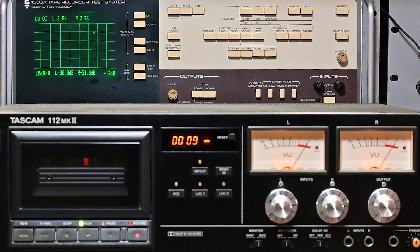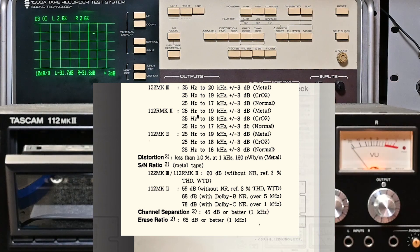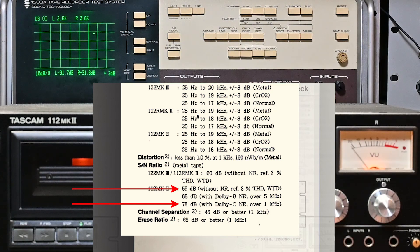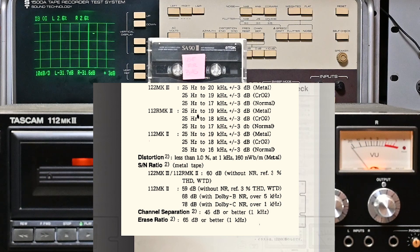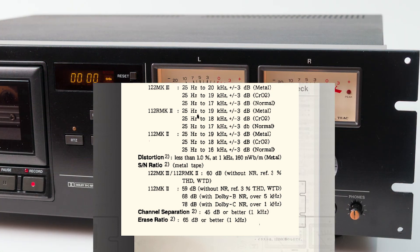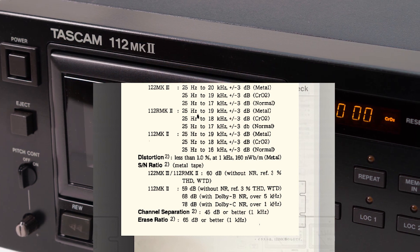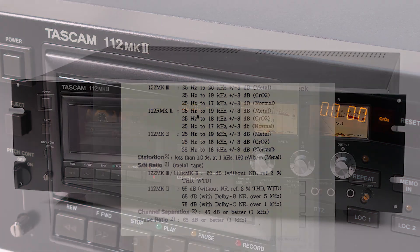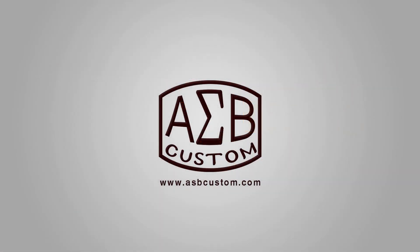Those are good numbers. The specs on the tape are 19 dB delta on metal tape; we're getting 16 dB enhancement on a type 2 tape. The deck was the last of these built around 2006, and I believe this TDK SA tape was from around the mid-90s — it's a pretty old tape. To get those kind of figures, I'm happy with it. I don't know that I could expect any more than that. So I hope that answered your question, and maybe somebody else enjoyed the video too — thanks for watching.